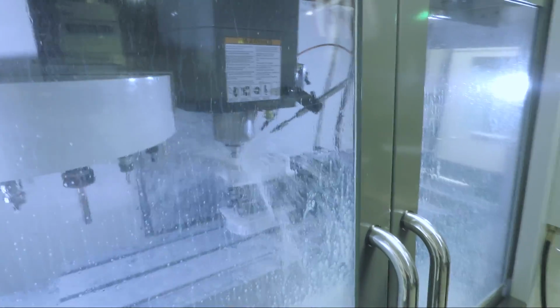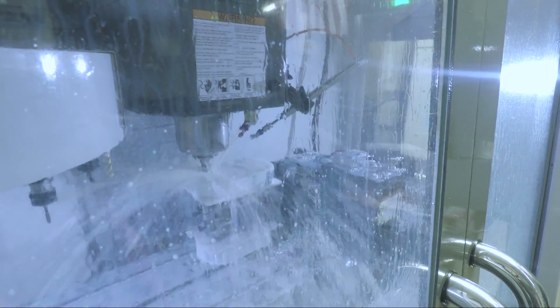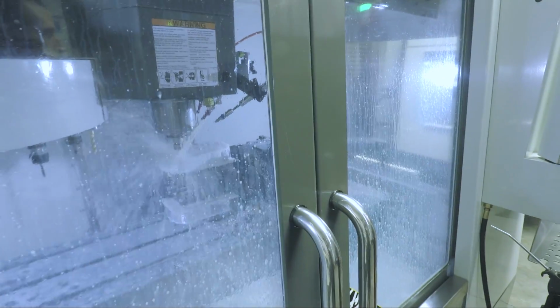No probe. I was thinking about that. I needed a probe for some of the job shop work, but when I think about a potential pallet system setup, I realize I don't need a probe. I'm modeling everything off of G53 and where the home position is. Correct. You just don't need it.